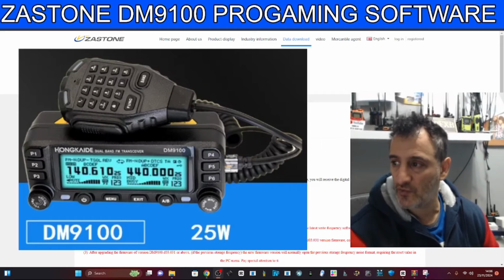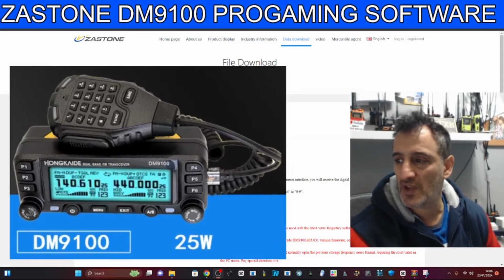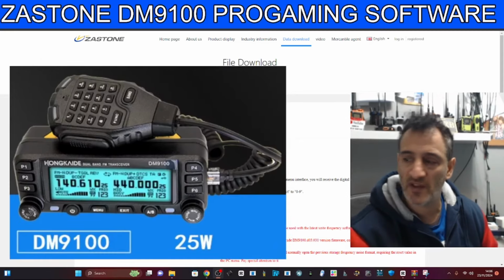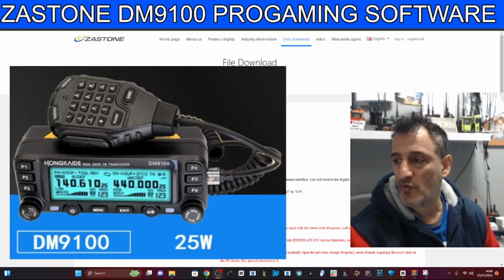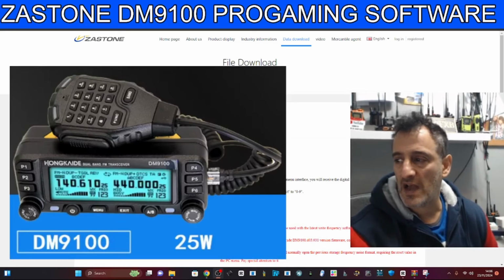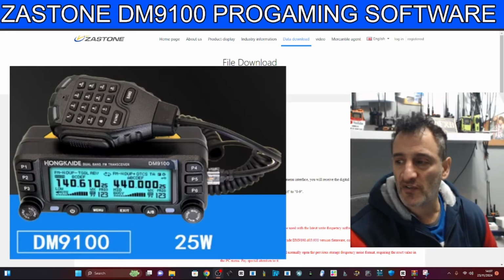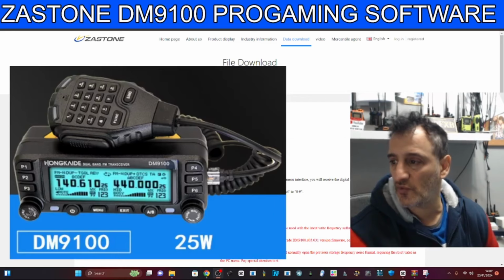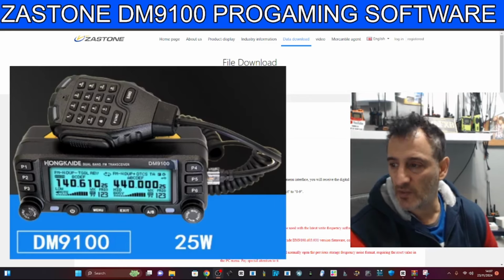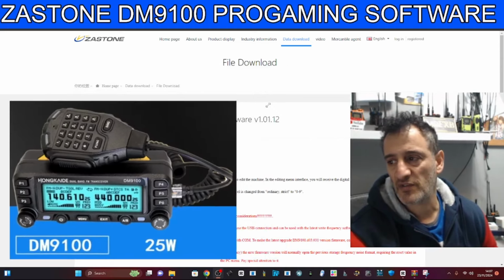Now it has its own unique code plug. You're still going to be using, in DMR, talk groups, slots, color codes, contacts. You have to use DMR. And then for analog, you're going to be using CTCSS and plus and minus shifts. That's as usual. You can see it's a dual receive device. Everything's built into it. The Bluetooth, the GPS, it's all built into it. And it's only about £185, which I think is a good price.